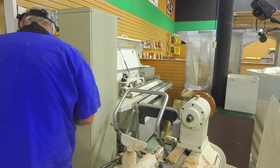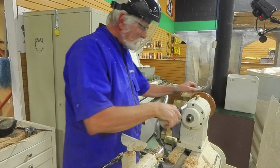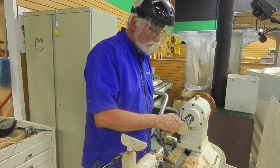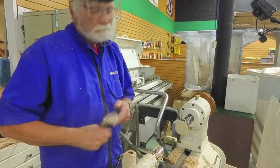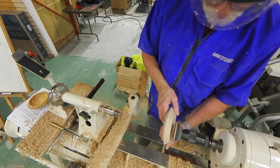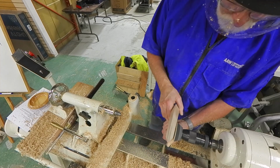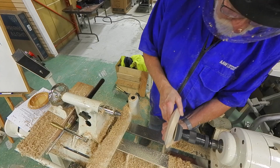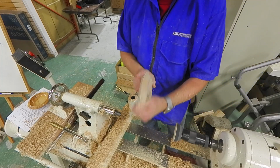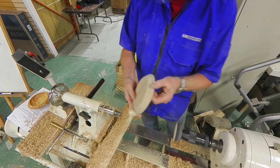We have a lathe. Another thing your lathe should have is a Jacob's chuck for drilling. And if you've got a little circular disc of sandpaper, you can buy those cheap. It's mounted on foam. You got a sander. Even reasonably safe. And this sands off in no time. If you keep turning it, you hopefully won't get a big divot there. And it's best not to try to sand over the whole surface because it's spinning. You just want one corner. But if you're not in a hurry, you can get a reasonable finish on that.